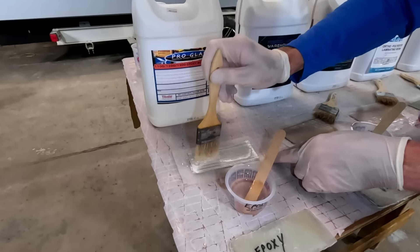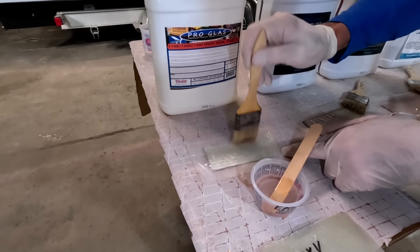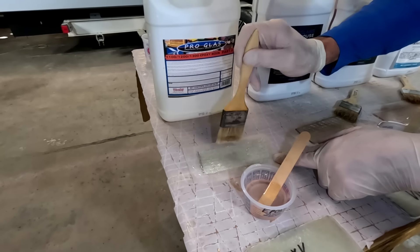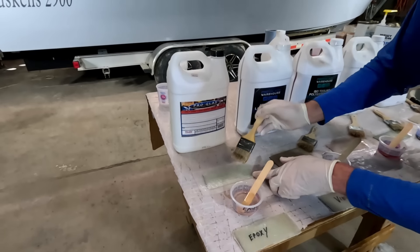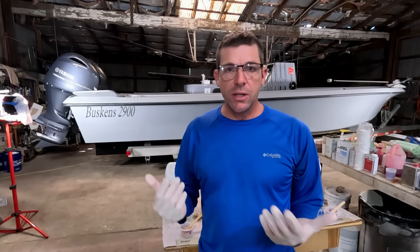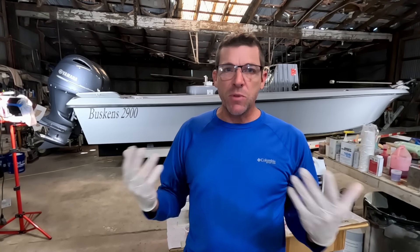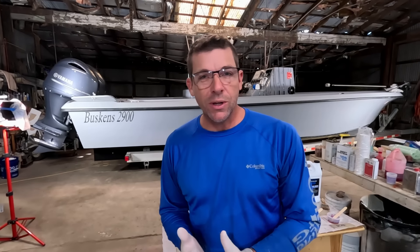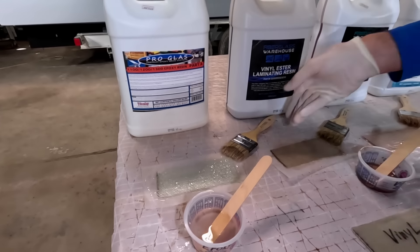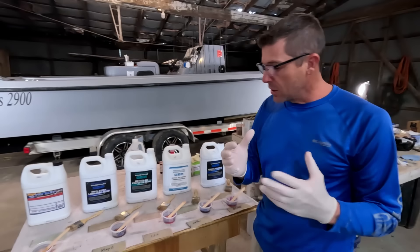Here we go with the epoxy. All of these are good materials — they each have a place and an application. When people ask what is the best resin, it's just hard to say. Think of metals: aluminum is great in the marine environment, stainless steel is great, titanium in the aircraft world is lighter and stronger, but the cost makes it prohibitive in some applications. So even though something is really good you may not always need to use the most expensive. You can see everything wet out very nicely; the epoxy is a little thicker and seems to take just a moment more to penetrate and saturate.